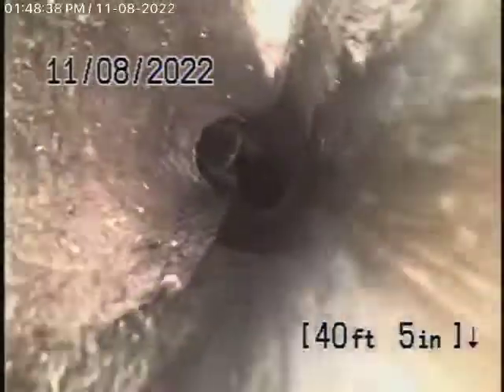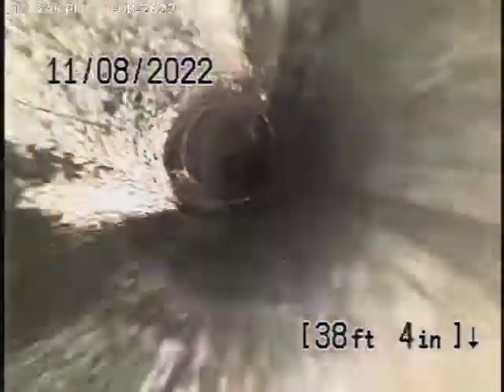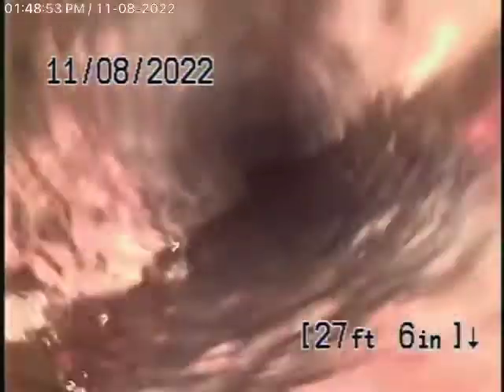That's the clean-out outside that I was mentioning. Now it's going to come underneath the foundation of the house — we're underneath the house, still in ABS plastic, and this is all visible. It comes back to the original cast-iron pipe, which is obviously getting a little old, but it still appears to be in pretty fair condition with some very minor rust buildup.